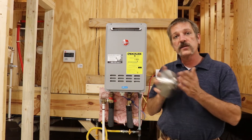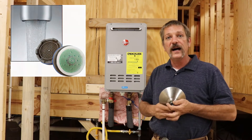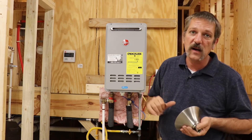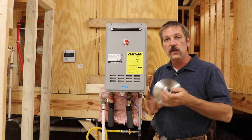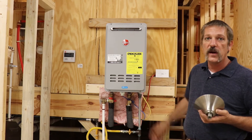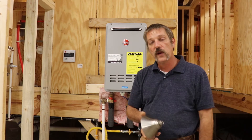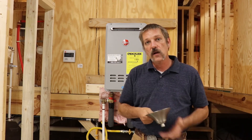Water savers are also in kitchen faucets, lavatory faucets, and many other plumbing fixtures. You don't really have to take them out of your kitchen or lavatory faucets — those tend to work pretty well and don't have that hot-cold issue, since you're just washing your hands or dishes. But you don't want a cold shower, so we take those out of shower heads. I like the flow rate at about two gallons a minute, but a gallon and a half should be alright. You can just remove that little black o-ring to render it useless, and it basically just works like a little screen.